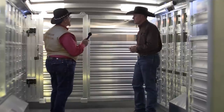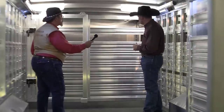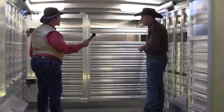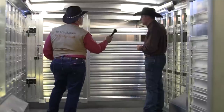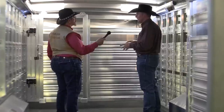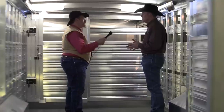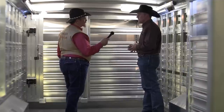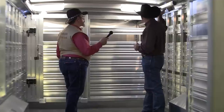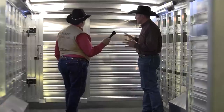How does the sliding center gate work? We have four spring-loaded latches on the walls that clamp around the post. We have a UHMW — a thick UHMW channel that just goes around the post, so there's no holes to line up. As this trailer gets older and you use it for several years, you don't have to worry about holes wearing out. These posts are set every 12 inches so you can set this gate at 12-inch increments. I'm sure you've hauled loads where you'd like a small compartment for a couple calves and more room behind it. Our gates travel on this overhead track — it's not fixed on the wall. We have a side ramp and a side access door on this trailer. We'll unlatch this here in a minute and move it all the way to the front so you can have one big compartment.